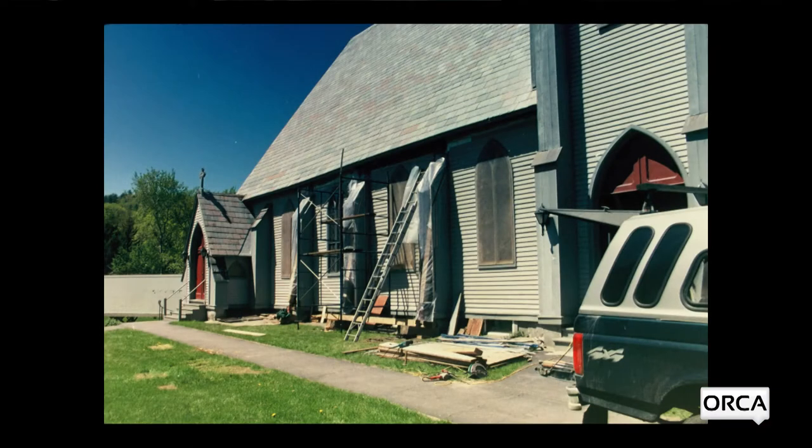Here we are. This is that same church, actually. English Gothic, like a lot of ones that are made of wood in New England are, they should be made of stone. They are not heavy enough on the outside walls to support the thrust of the roof system inside. And they have false buttresses. We're trying to put real buttressing inside the false buttressing. But there are some that do have real buttressing. I looked at one in Claremont, New Hampshire the other day that did.